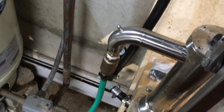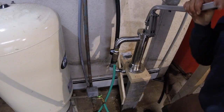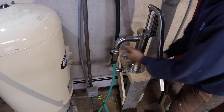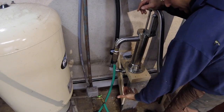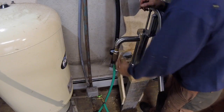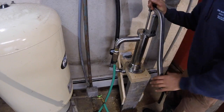That usually takes putting in a ball valve and closing that ball valve when you're using the Bison pump. That ball valve is normally open when the Bison pump's not in use. The static water level in our well has to be no more than 24 to 25 feet from the pump down. So you have to have pretty shallow water to make this work. That's a good reason, if you're looking at properties, to choose one with a shallow static water level — higher than 25 feet — versus a property that's 100 feet or 50 feet. If it's 30 feet deep, you can't do this.